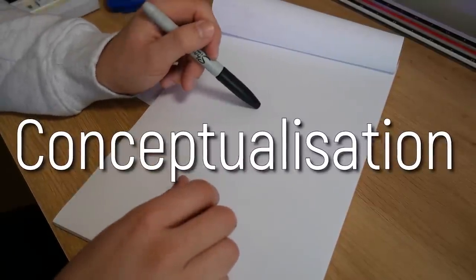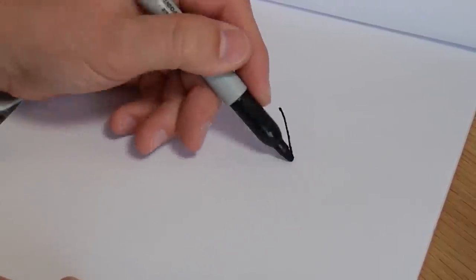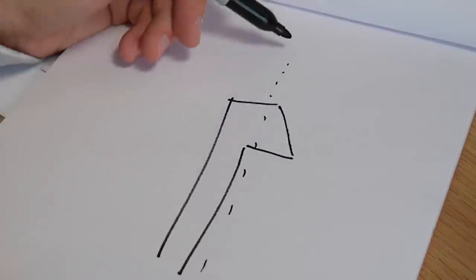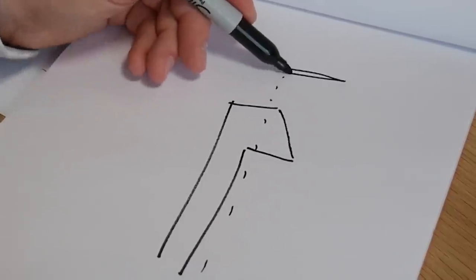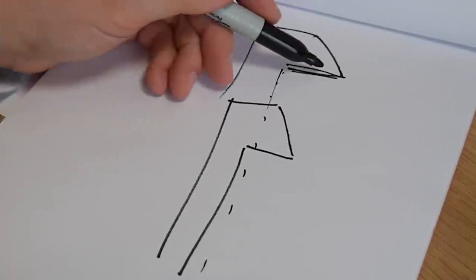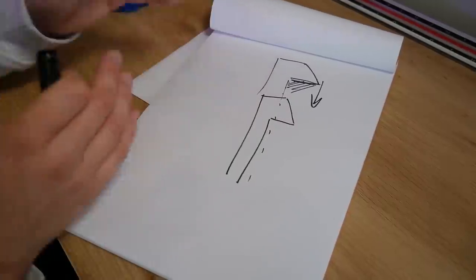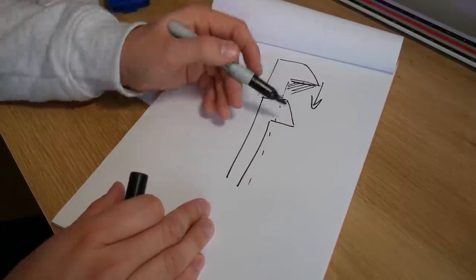Let me draw on paper the basic principles of how all these mechanisms work. You have a ramp on a prong. As it comes up, it meets some plastic with a ledge, deforms to travel along that plastic, and then snaps up into the ledge. Once it snaps into place, that edge prevents it from going back out. This is how all of these designs work.